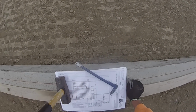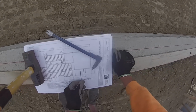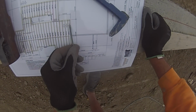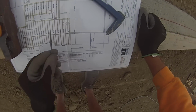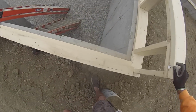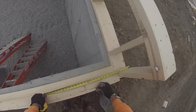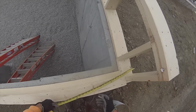Okay, so the layout of the floor trusses starts at the back here. We're standing right here. It's 1'5 7/16" to the edge of this one. And away, all the way across. So, hook on the outside of the building. So, 17.5 is actually the number I use, and away.